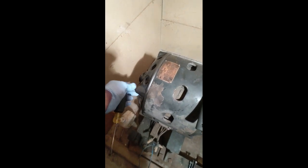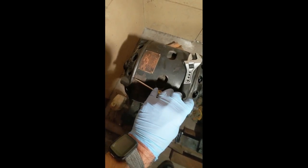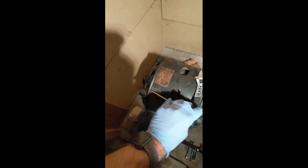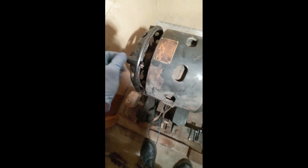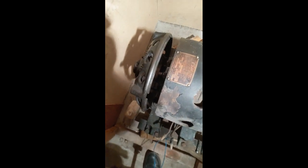So now we take out the last bolt. Pay attention to which side the oil trough is facing — the cap is facing up. You don't want to tip it upside down because you'll dump all the oil out. Once the screws are out, you put a screwdriver up against the corner of the bell and tap it with something light, like the wrench you've been using. There's the bell — you can see the screw holes went right through — and you just tap it and it pops right off. It's just sitting there on the shaft and it's free, so we're going to lift it off and put it over on a work surface.